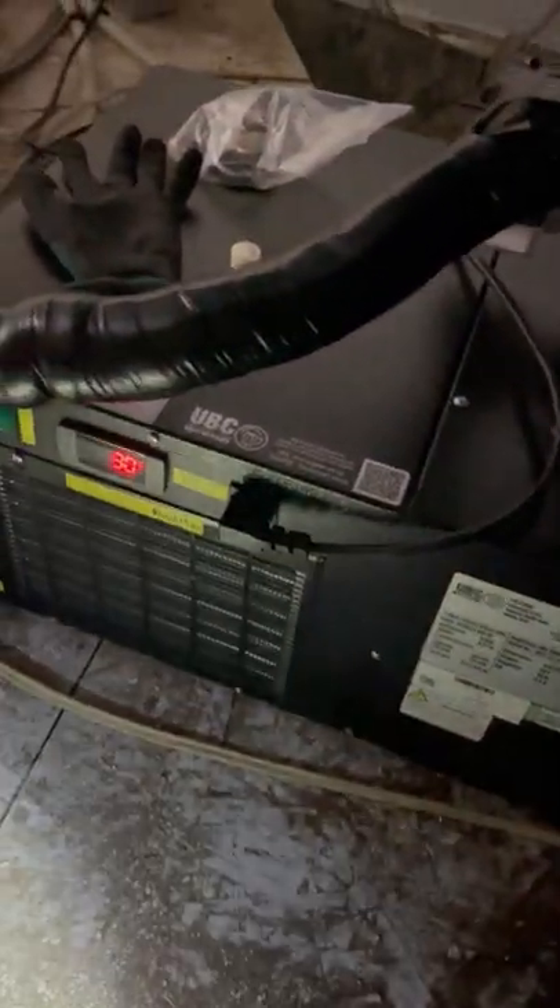Every six months or so you want to check the fill level of your glycol reservoir. You just pop off this cap with a flathead screwdriver and take a look inside — you'll see some coils. We just filled this up, so we're doing a little topping off, but you can see there's liquid in there with just a little room on the coils. Make sure it's not drastically low. You may need to top it off with water or more glycol — we use a 40% glycol to 60% water ratio. Call us if you need information on acquiring more glycol.